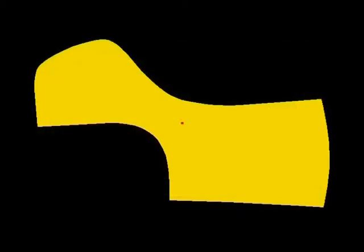Counterparts should be cut with distension sense to the widths, from the better part of the skin, next to the cut of the uppers, toes, and vamps. The length piece can be cut from areas of smaller quality where small defects may pass; its distension sense is to the length. Pipings, straps, and buckle straps should have their distension sense to the length, and they can be cut from flexible skin, but never from parts that are not exploitable.